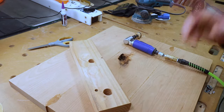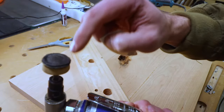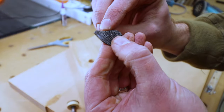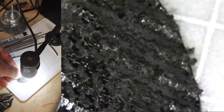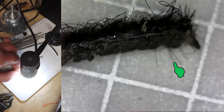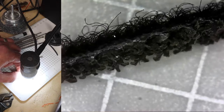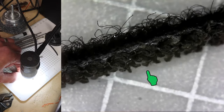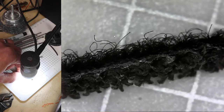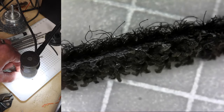Okay, lost it. Now this doesn't stick very well. This is a really exaggerated version of what's happening on the sander — here it's pretty well melted. You can see fully melted hooks on the edge, partially melted hooks in between which don't hold at all, and full intact hooks that have not melted in the center of the pad. You'll see this on the sander as well when the pad starts going bad — a lot of times the edges start going bad first before the center does.